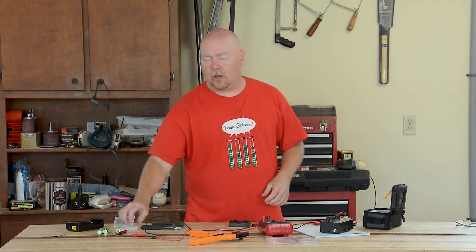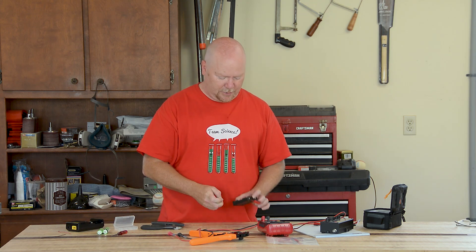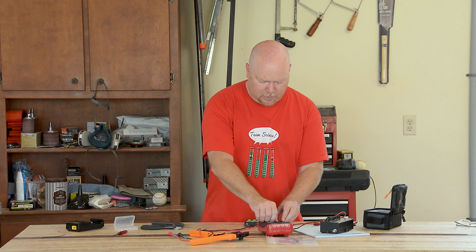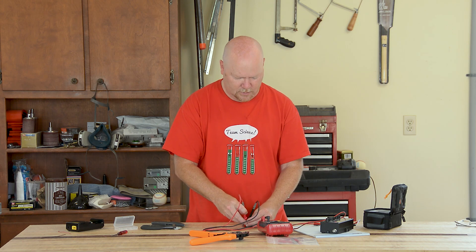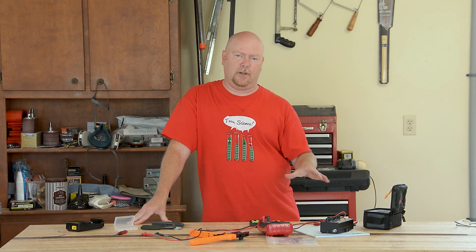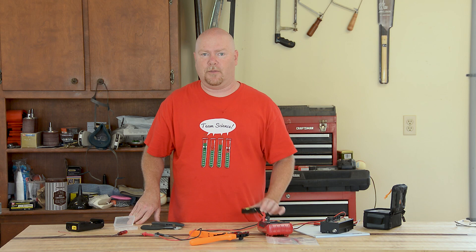With the pack all assembled, first thing I'm going to do is make sure I do not have any continuity between the poles. I do not want a short circuit when I go sticking three high-capacity lithium batteries in. Always remember, there's a lot of power in one of these things and kind of an unstable chemistry — a bad combination to get wrong. Let's get them loaded up, get the meter back over here on 20 volts DC, and see what our power poles have to say. 12.54 volts DC — that's perfect! That's actually slightly higher than what the built-in battery shows when fully charged, which reports 12.1 or 12.2 volts, so 12.5 is definitely at least as much charge, plus the much higher capacity batteries.